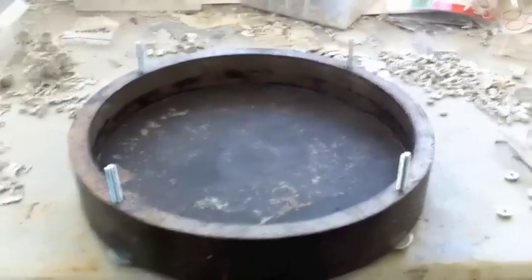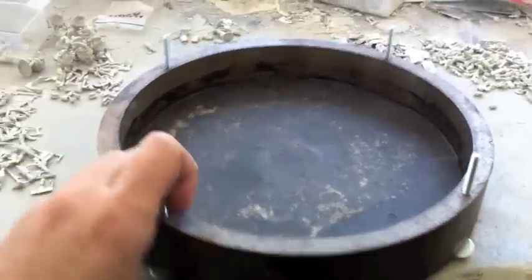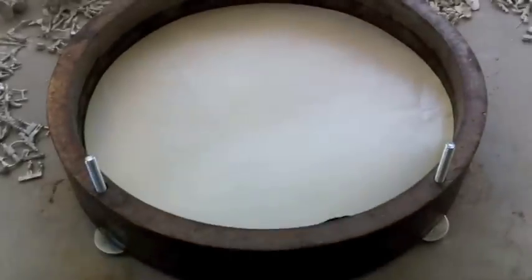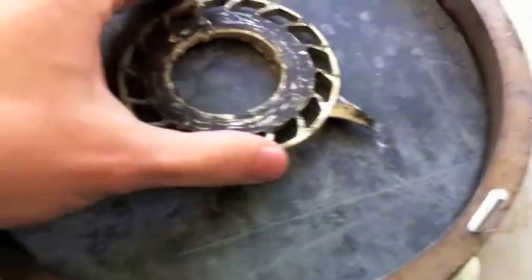So this is the mold can. I've taken four three-inch bolts and run them up through the can. From the first video, I've got a nice washer on there as a spacer. Then I usually put a piece of mold paper — these are in the box of molds over here that separate the mold pieces — and I put those in the bottom just to keep the mold from sticking to the can when I pull it out. I'll put it in the bottom half, seat it in there, and put my center form in the middle.